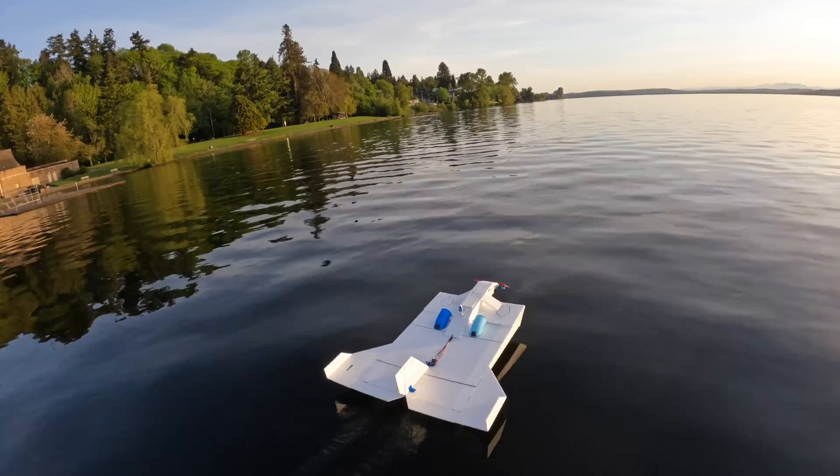The first thing I did was take a 3D scan of the nose of the airplane using the 3D Maker Pro Lynx scanner — my first time ever using a 3D scanner, and it's pretty cool. After post-processing, I brought the model into Onshape to get all the critical angles needed to design the parts, including gears that connect the canards and wands. Onshape is free for hobbyists and all files are linked in the description. Then I SLA printed all the parts on the Form 3 Plus and installed them on the airplane.